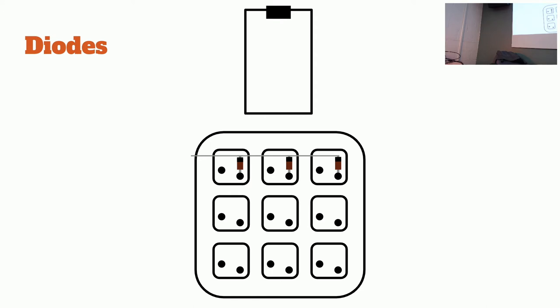Correct. We don't really care what's happening with the wire on the kink side. In fact, we're going to cut those off eventually. Perfect. So once you have those lined up, it doesn't have to be perfect because we're going to solder these right after. So just line them up on the switch posts. If you want to wait to bend them, that's also fine, because once they're soldered in, it may be easier to then bend over the leg.